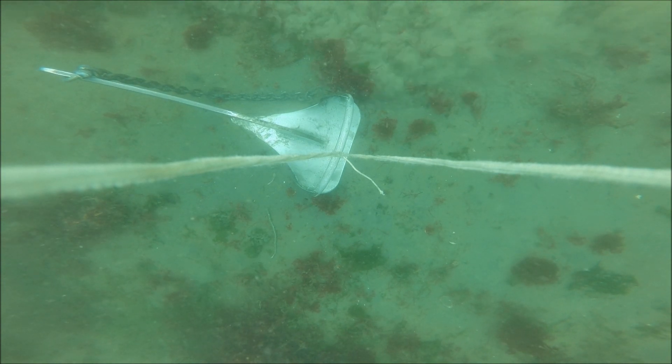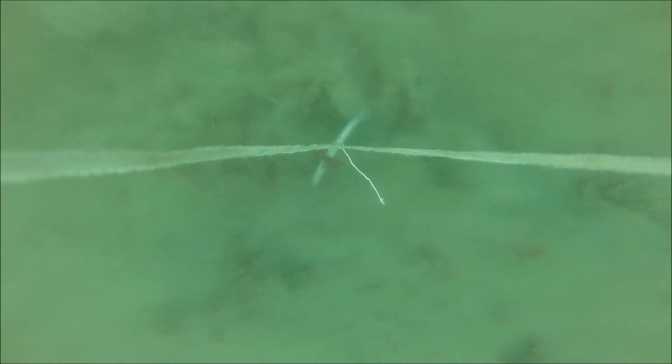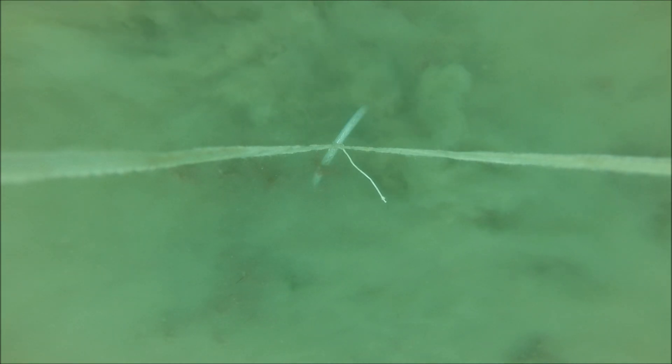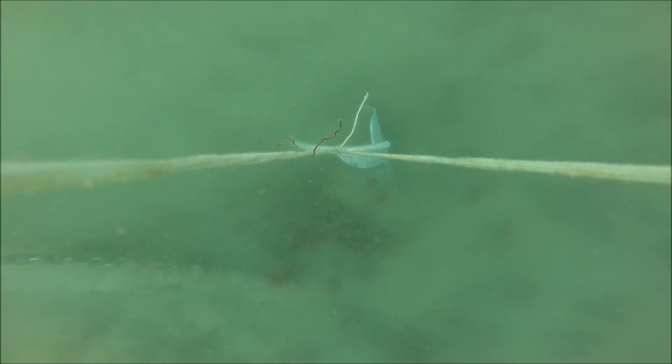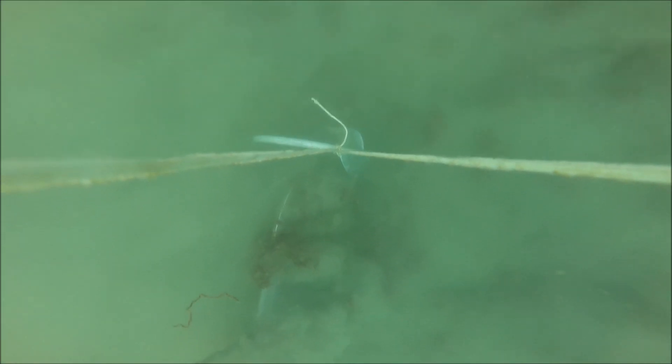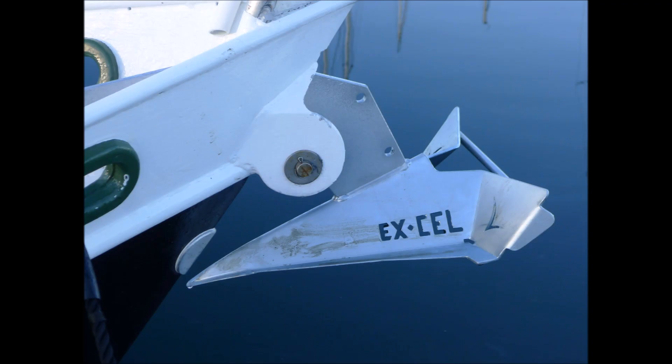So I've welded on some much larger panels. Here's the anchor over on its side. My theory was that the panel is going to keep the edge of that anchor from forcing into the seabed, and that'll keep the angle of the tip more aggressively toward the seabed — keeping the back of the anchor up and counteracting the weight of the mud. Here's the initial set — perfect performance as always. Here comes the first reset — that was fair, took a little bit longer to stop the boat, but it did. On the next try, it's a failure. I did about 10 tries on this modification. That was a bust — no improvement, and in fact it made the anchor worse. Seemed to have quite a bit of seabed attached to it. So I ground those ears back off and I'm back to the drawing board.